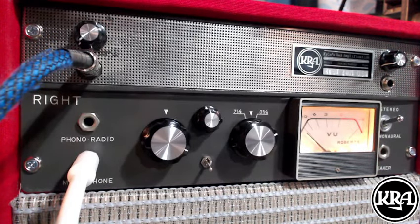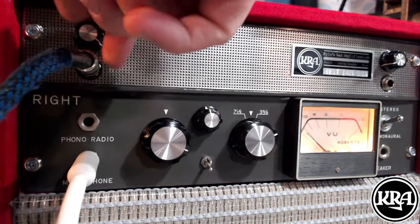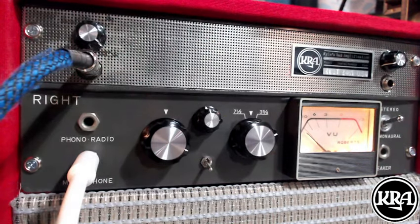So now I'm going to start blending in the tremolo, and there's a neat side effect of the fact that we're power tube bias modulating the tremolo here, and so that's also where a lot of the saturation is happening in this overdrive tone. And so there's an effect of the overdrive sort of overpowering the tremolo in the first part of the attack of the note, and then sort of blending in the tail of the chord or the note that you're playing. So here's a quick demo of that.